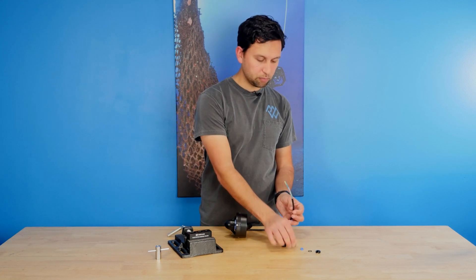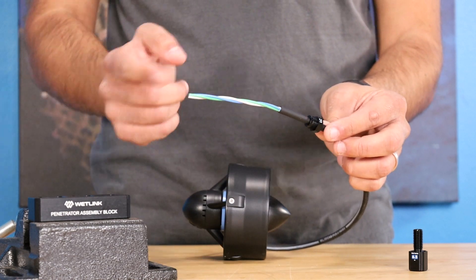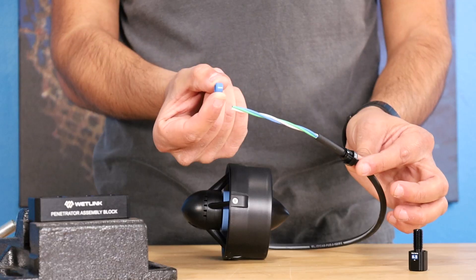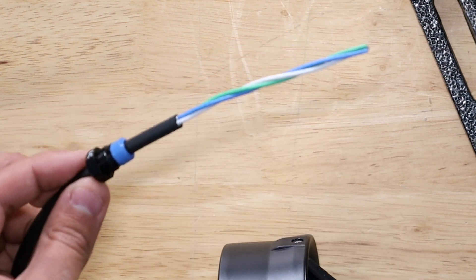The first thing I'm going to do is take the plug — that's this part of the wetlink penetrator — and install it down onto the cable jacket with the threads pointed towards the end of the cable. Next I'm going to put on the seal. You can see the seal has a tapered end. I'm going to put the flat end, not the tapered end, against the plug and slide that down over the cable.